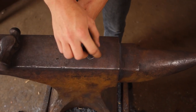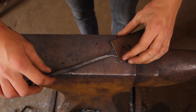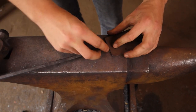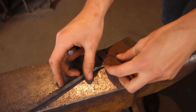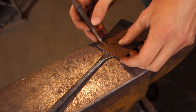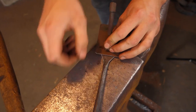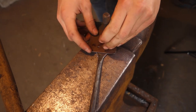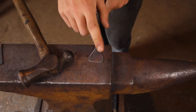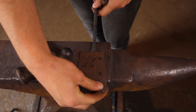I've cut it off from the main bar and just refined the shape of this end. I'm now going to center punch where these holes should be. I'll just put it on over the top so we can have a look and see if it's square. Then I'll drill these as well to 4mm so we can rivet the forged piece onto it.